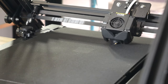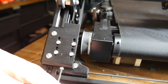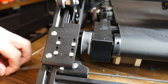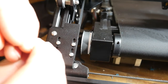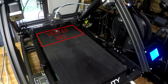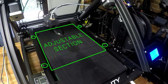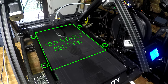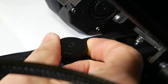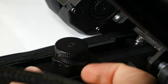When the printer homes, it only homes X and then Y. Y is responsible for the gap between the nozzle and the belt. To set this distance and therefore our first layer squish, we have an optical sensor on the lower left of the frame, and by turning the bolt we can move it up or down to change the point at which it triggers. The heated bed is underneath the belt and only takes up a relatively small section of the belt's length, mounted together with a flat metal plate, the whole thing suspended on springs and adjustable like your regular bed on a 3D printer. In each corner is a knurled thumb wheel, and when adjustments are finished, there's a locking knob underneath that tightens down and prevents that corner from moving.